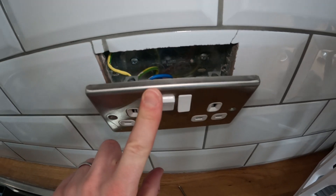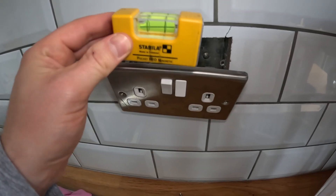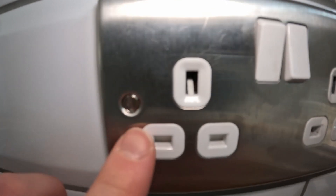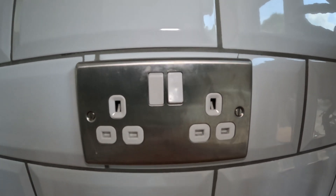First I'm going to reconnect that socket so that the power can continue. I've got this socket reconnected and I'm just going to screw it back on. I like to use this mini level just to make sure it's level — screws vertical is my preference, but I know it's not everyone's bag. The next split is in our utility room — we've got a washing machine and tumble dryer. I had suspected the fault might be in here where the washing machine had previously tripped a few weeks back. We've also got an outdoor socket spurred off here, and we've had quite a bit of rain, so potentially some water in there could also be causing it to trip. I'm going to split the radial just before that.